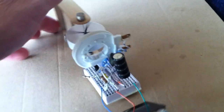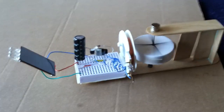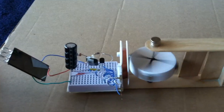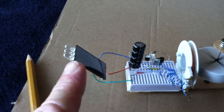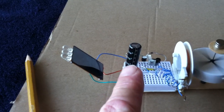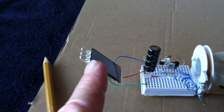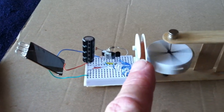It's really a nifty project. He's got his all in a box — it's all boxed up and it's a much better rig. This is a prototype rig here. To give you an idea of the dynamic: it's a solar panel with a blocking diode that charges up either a lithium-ion rechargeable button cell or a super capacitor, with LEDs in parallel that pick up the flyback when the coil field collapses.